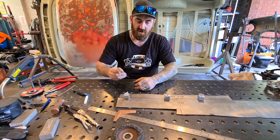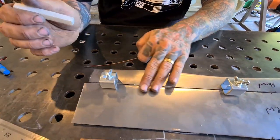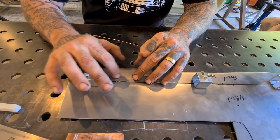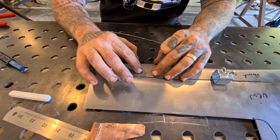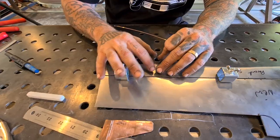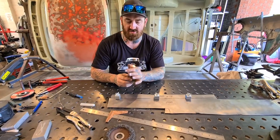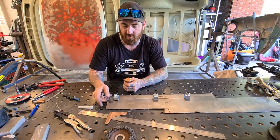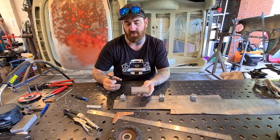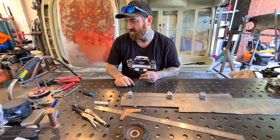If you do find you're blowing through and end up with a blowout, don't hang around there trying to fill it whilst getting it hotter and hotter. All that's going to do is give you less metal to play with and you'll just keep chasing it. Stop as soon as it blows out, come back to it. If you do that there'll be metal there you can play with. If you can get behind it I'll show you later what to do when the gap's too big or you've got a blowout.